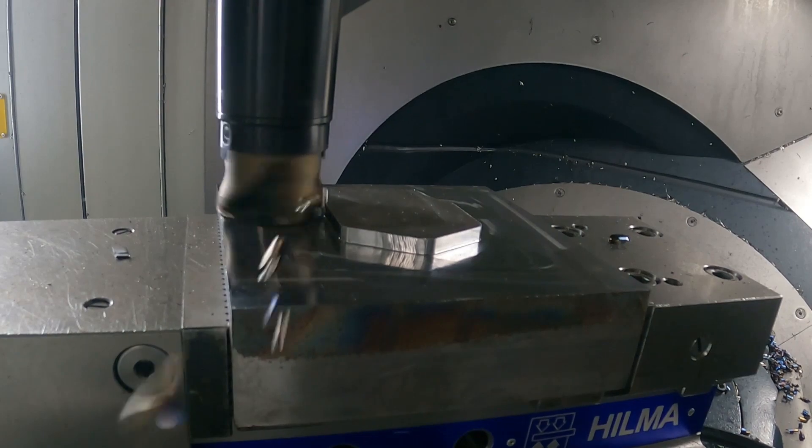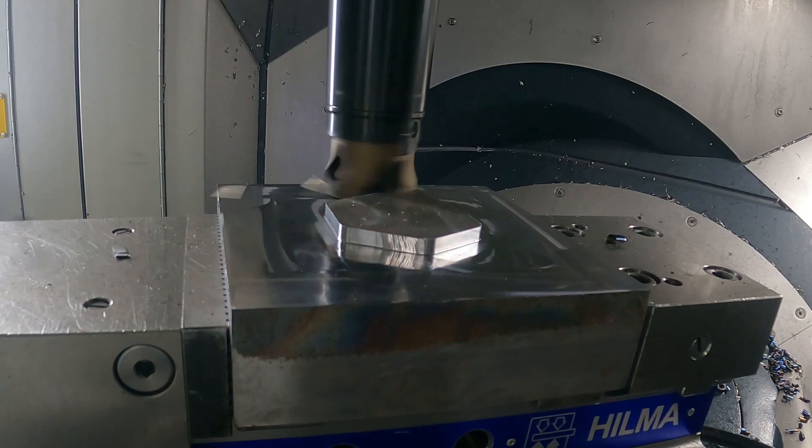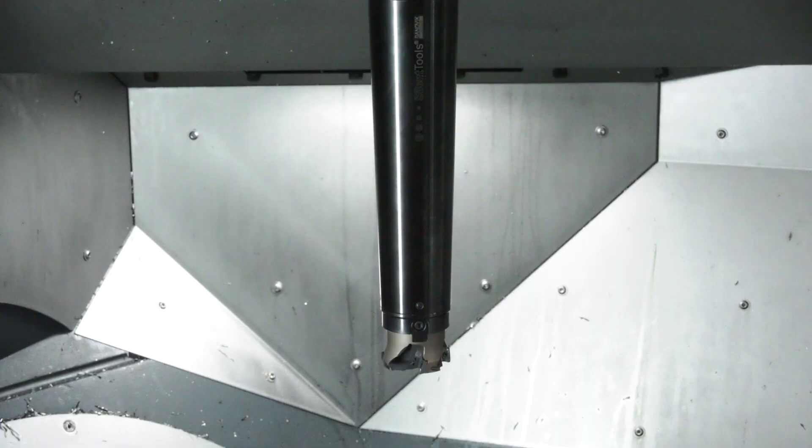So what's the benefit of having a lighter cutter when you've got a longer overhang? It's all to do with weight. The weight has a massive factor when you've got long overhangs. The heavier the concept on the front of the arbor will tend to bend and make the overall build-up flex a bit. With this concept now, there's a great deal less material involved compared to steel, which gives it that lightweight action.